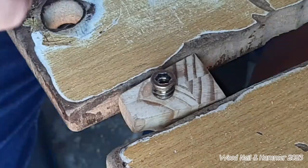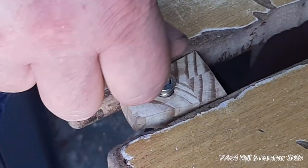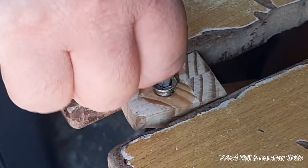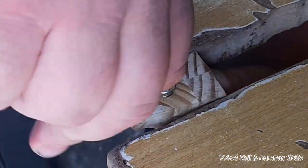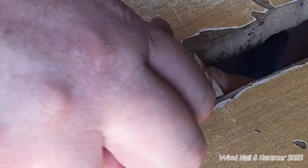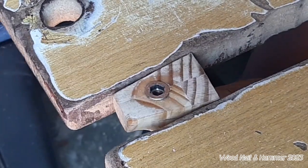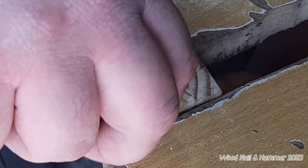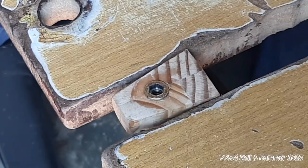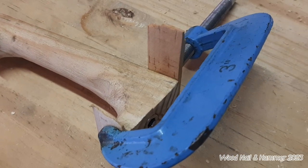It was really tricky drilling the hole for the threaded insert at the correct projection angle, and every turn of the Allen key was surely nerve-wracking, hoping that the heel block doesn't crack or break. Shortly after I stopped the camera, I gave the threaded insert one final turn and the heel block did actually crack. So there's your bad news for this minute of the video. I filled the crack with glue, clamped it, left it overnight, and hoped for the best.